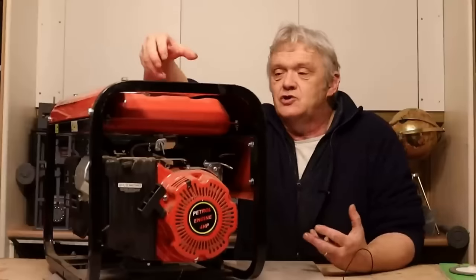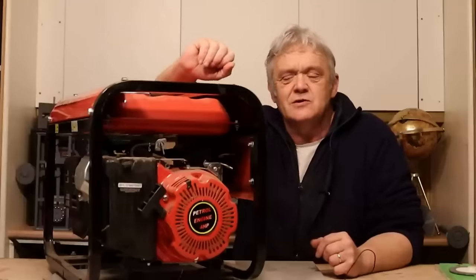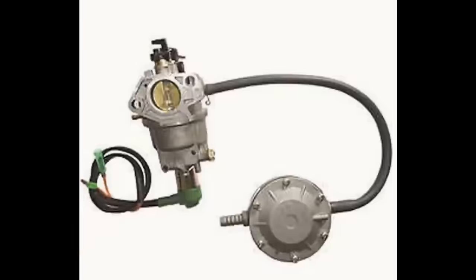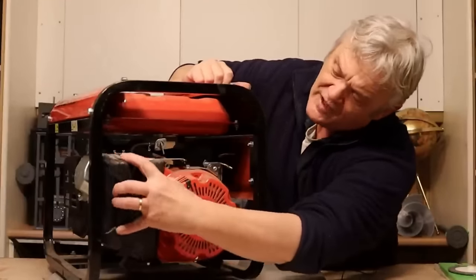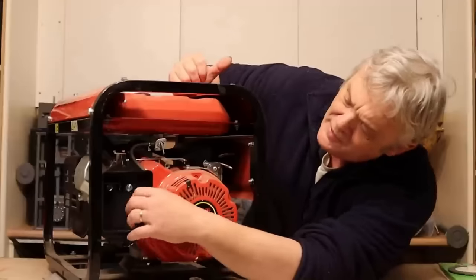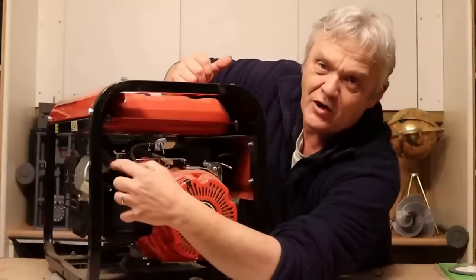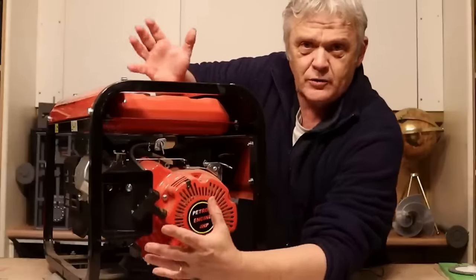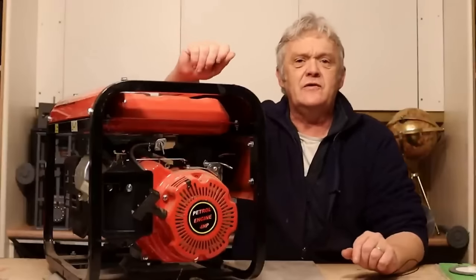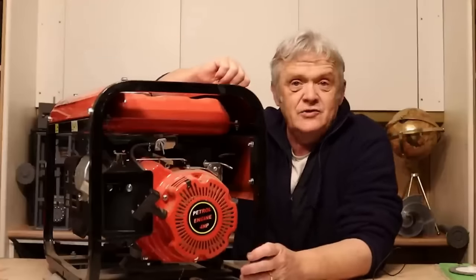The conversion of these generators to LPG is a huge misconception - it's just ridiculously simple. You can buy kits, but right here is the air filter. If I remove the air filter we have a sponge, take that away, and there is the actual carburetor. If I take my gas hose and just dangle it there and sellotape it on here, then turn over the engine, the engine vacuum will pull the gas in and the engine will run just fine. There's a difference in the air-to-fuel ratio you have to introduce, but you can fiddle with that by twisting the valve until you get the right ratio.